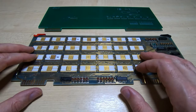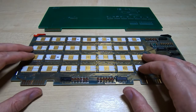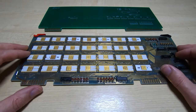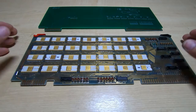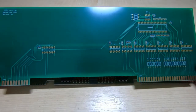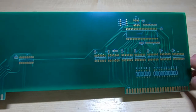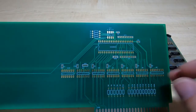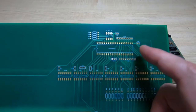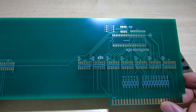It might be that the lines actually enable or disable the outputs rather than driving them all high or low, but I'll have to see how that works. Either way, it's not a big issue — it would just be a very small modification to the card. The next step is to get this card built up. I'm going to be using sockets on the prototype simply because I might need to modify the design, or if I need to try different versions of code in the EEPROM. Also I want to be able to put in some test code to test various parts of the machine, which would be extremely useful for future-proofing it should any more faults develop.